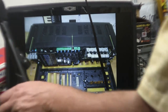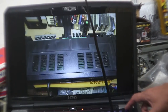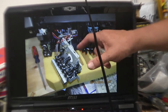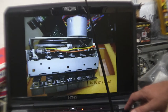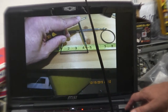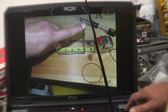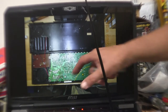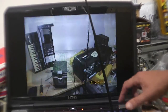Okay, it's jumping off, it's motoring on. There's pictures I took again. There's a screw that goes right there, just one. Here I have the unit out - or the tape deck out - to put new belts in, and I shot four videos showing and explaining that. Here I am measuring the main belt, and that's the secondary belt. Then I get it back together. I had it back together and I opened up the keyboard to spray in there.